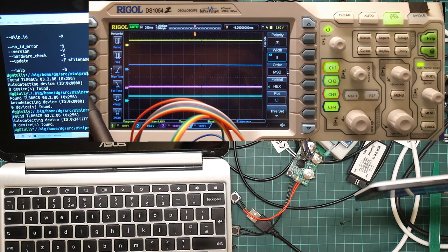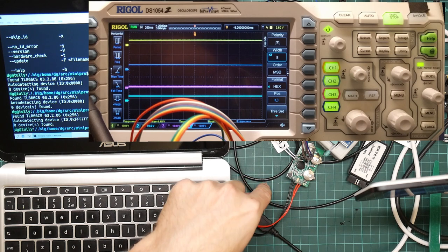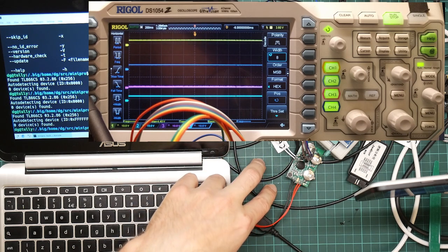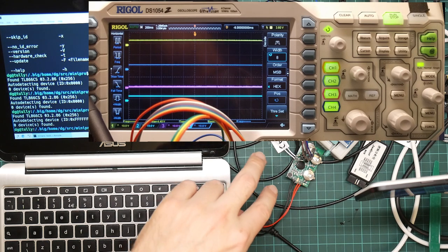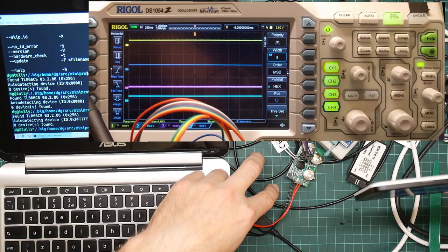Now there's a solution, and this is to cut the chip select line between the flash chip and the blob. This will render the device non-functional. So I will have to have a hunt around for a solution to that, and also identify the various traces on the board.